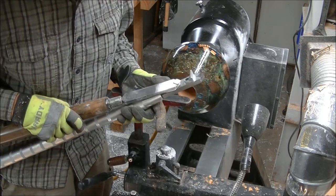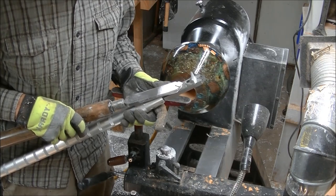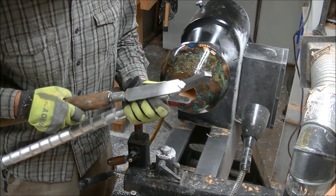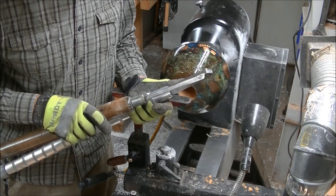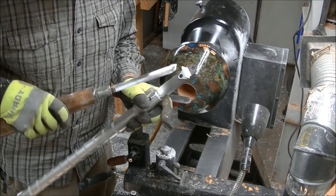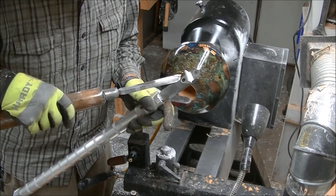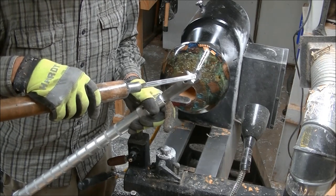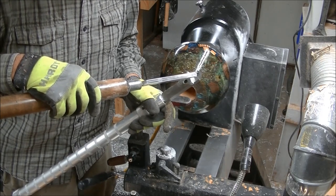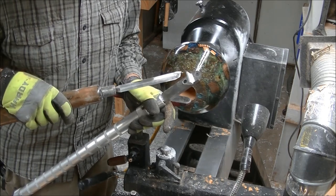But you see, it's maybe, I'm gonna say, at the most a quarter inch narrower. But he uses half inch tool steel, and mine are made out of just mild steel. Plus he totally sets his cutter in right there. Now, I've got to change that cutter out because that's an R4. I like an R2. R4 is a 4-inch radius, and I like a 2-inch radius.